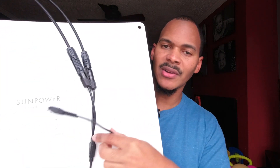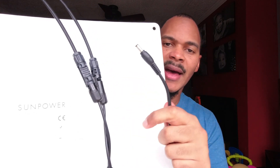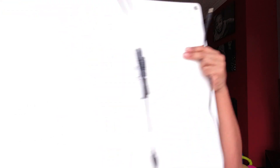Here is what one of those cables looks like. You can see that it's hooked into the SunPower panel — MC4 is connected in and it has a 5521 on the end, a barrel connector that plugs into your power station. The common MC4 connector type is also waterproof. A lot of people spray some silicone stuff on it to make sure they're waterproof, but I take them as being waterproof — I lock them in and just forget about it.